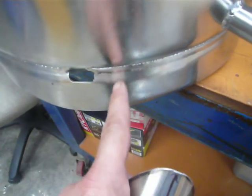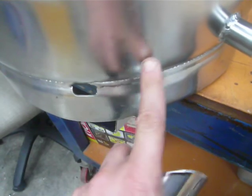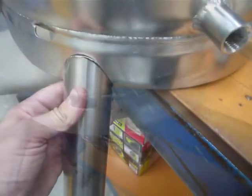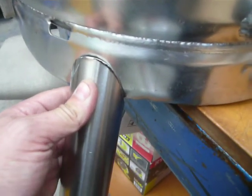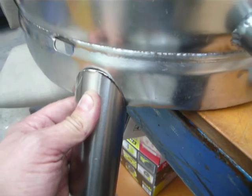The reason for that is I just don't want to have to go passivating the inside of the kettle again. If I weld around there, there's going to be oxidation and whatever left on the inside. Welding on the skirt, I don't need to be anywhere near as delicate and prissy about it — I can just blast a nice weld around there.